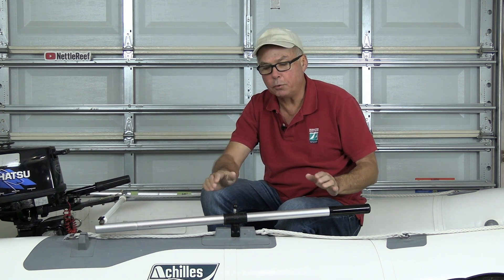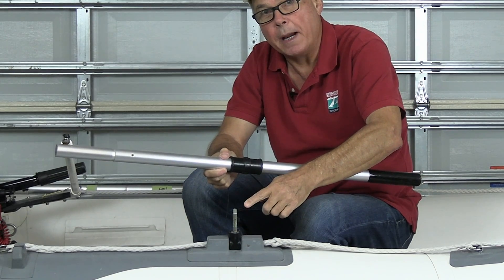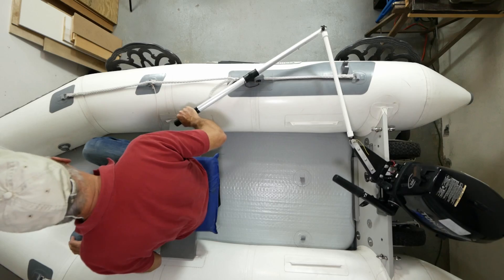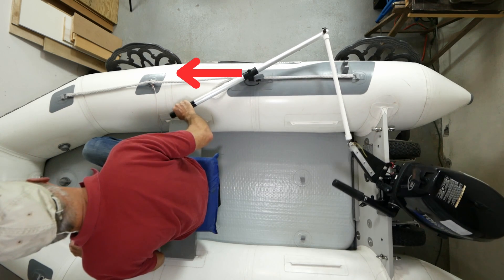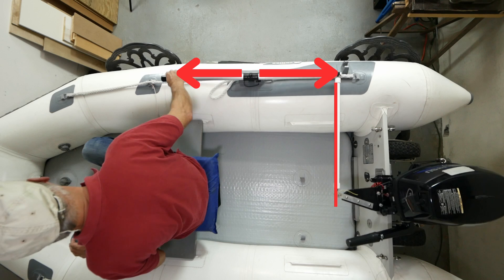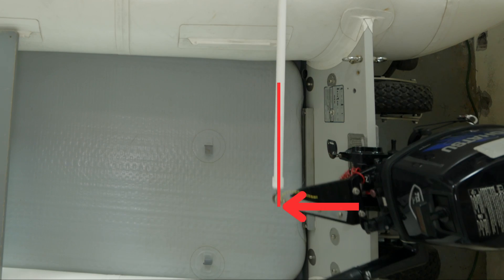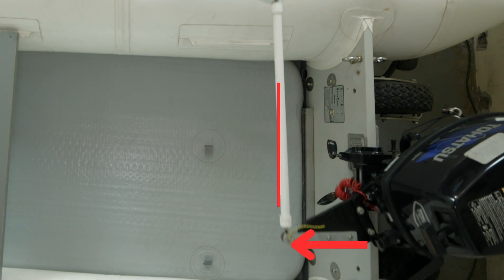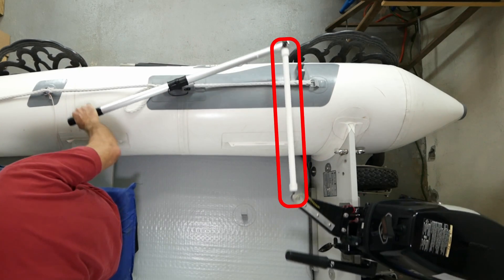This design requires a pivot point for the steering arm that is approximately halfway between the driving position and the motor tiller. Most small inflatable boats will have an oar lock or a pin like this in a good spot. If your boat has hard gunnels, you may be able to easily install an oar lock pin like this. The steering arm pivots on the oar lock pin. It extends forward of the pin to a comfortable steering position and aft of the pin to a length that aligns with the forward end of the motor tiller. The motor bracket attaches to the motor and extends forward to approximately the length of the motor tiller. The tie rod links the steering arm to the motor bracket with tie rod ends.